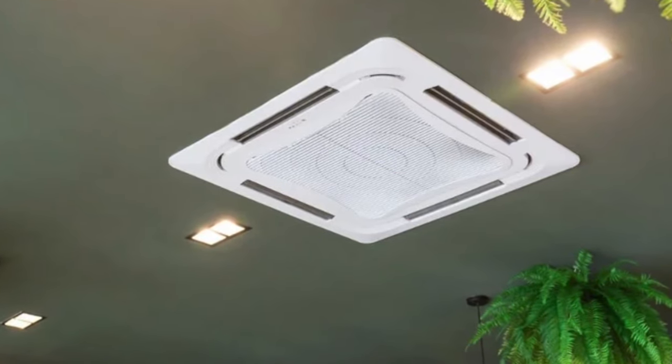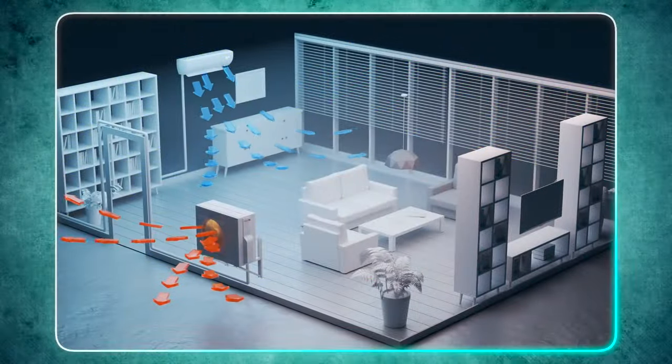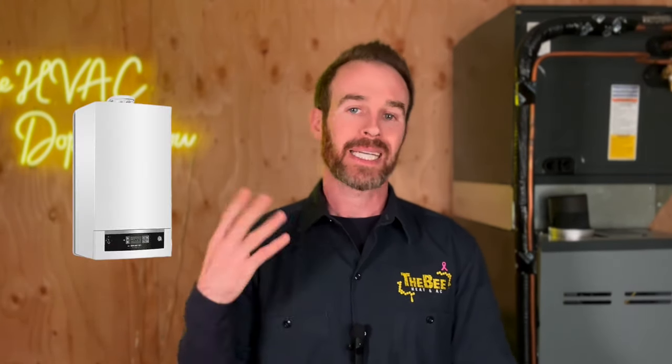I personally like cassettes because of the aesthetic and the fact that they don't have a footprint in the room. Ductless systems in general do a wonderful job cooling, and if we ever have a customer with very demanding cooling needs — meaning they like it very cold, or the master bedroom is on the top floor and it's very hot upstairs — ductless options provide a superior level of comfort because you're able to specifically target the area of the home you want to air condition. Most multi-port mini-split options are also heat pumps rated to perform well in cold weather, making them an excellent source of backup heat for someone whose primary heat source might be a boiler. In fact, for our technicians in Colorado, the most common application of a ductless mini split is in homes that have boilers because they don't have ductwork.